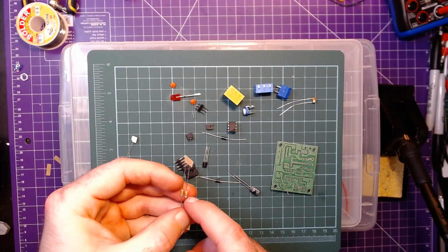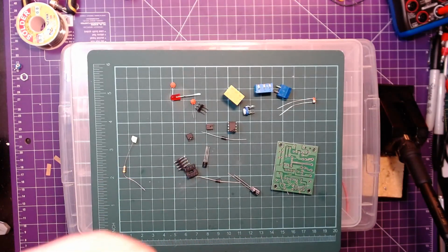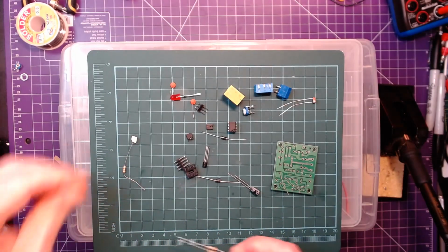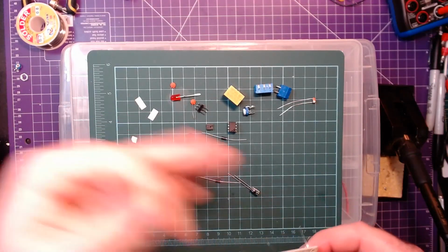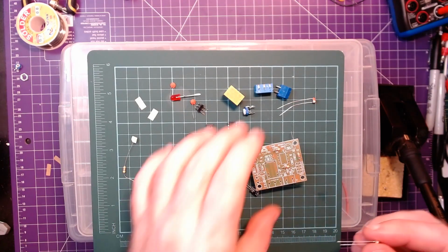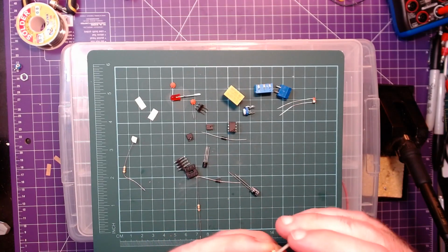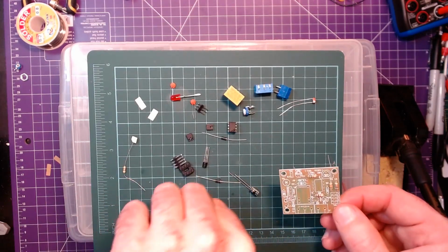All right, so we got brown, black, orange. See, orange is one of those colors you don't get a lot. I think it's 3. Yeah, 3. So 1 0, 3 zeros, 10K. So we've got 2 10Ks here. I'm trying to remember, but I do have a sign posted on the wall there. I think brown, black, yellow. I can kind of remember. I've tried there's a mnemonic for it, like there's some that are not politically correct anymore, but it doesn't help.